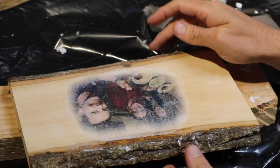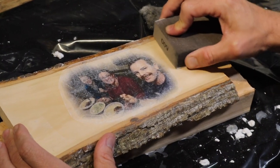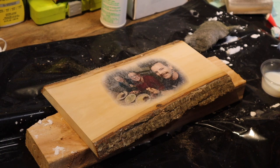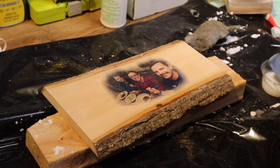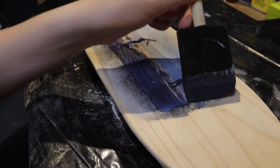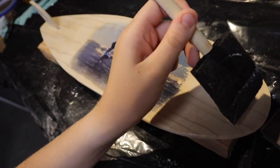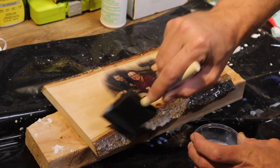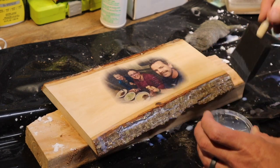This is also an opportunity — if you didn't fade the photo in Photoshop, you can very gently sand into the edge of the photograph itself and give it a nice fade into your wood. Now we're going to go back in with some more clear polyurethane, and for this top coat I'm actually going to be doing it in a gloss instead of a matte — I want this to really pop. You'll notice as soon as I put it on there, that haziness goes away, which is exactly what you want. I'm also going to coat all the way around the edges to hold everything together and make it look a little bit neater.